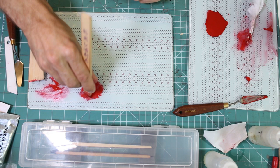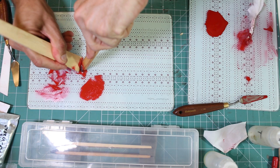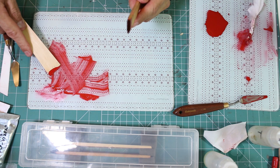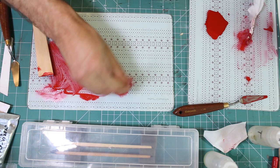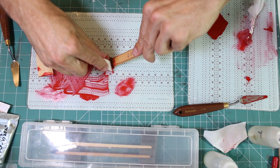This cleaning has several different objectives. First, it cleans the hake of turpentine, residual oil, and Urushi from a previous session. Second, it gets rid of dust — even in a clean environment the hake catches dust, and this dust will destroy the surface of the pen or any other object you are lacquering. Third, it gets rid of any loose bristles. They are very high quality bristles but they can still break or split, so working the brush on a surface and scraping it with a spatula removes any broken bristle pieces.